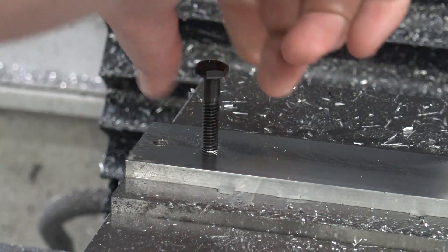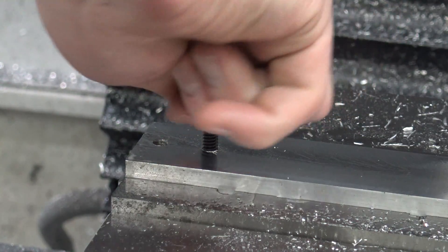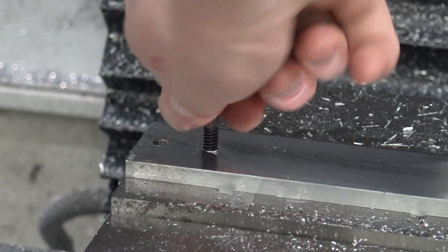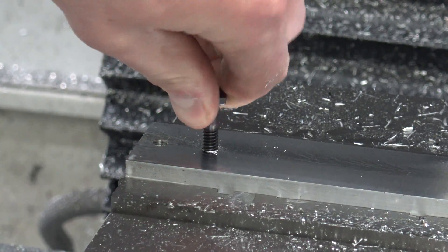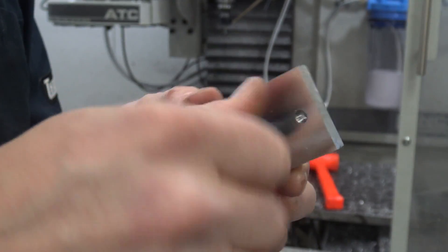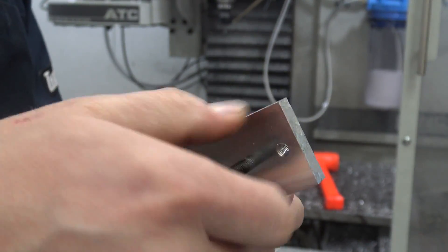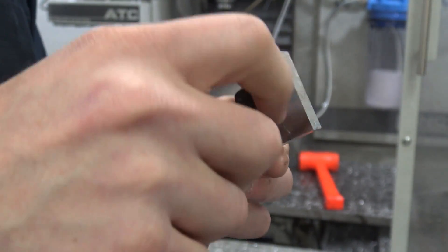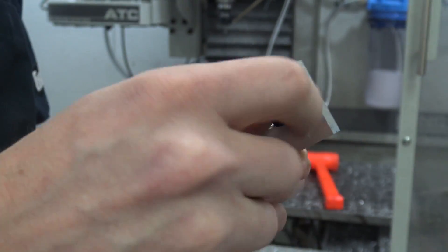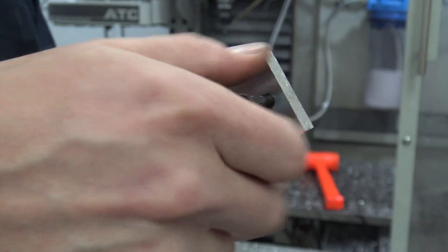Might be too tight... nope. Oh, look at that, folks. A little bit snug at the bottom — just using my fingers here — you just can't budge it. Awesome. Both holes are fine, but that thread milled hole — what a great fit. You heard on the third and fourth pass it was taking a heavier cut. Hopefully the folks at Fusion will come out with a way to do incremental width of cut. Nothing wrong with the tap tool, but you can see a little bit of slop to it. Hope you enjoyed — see you next Friday.